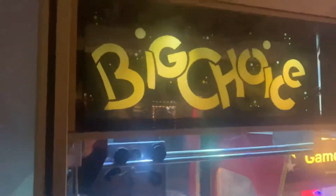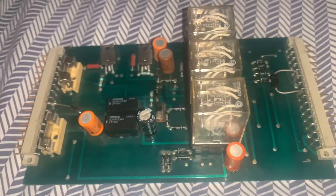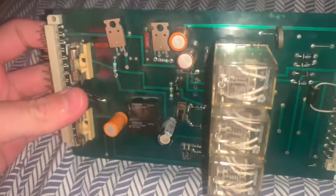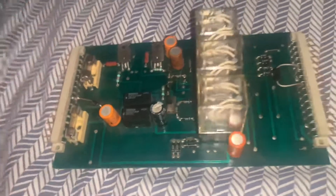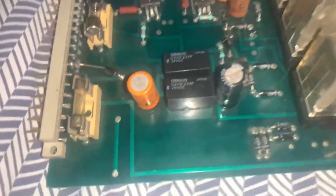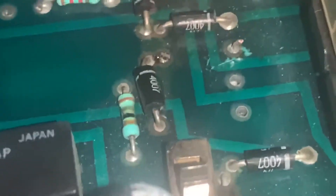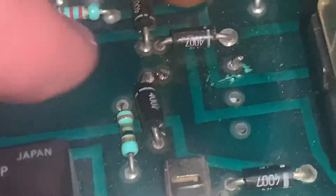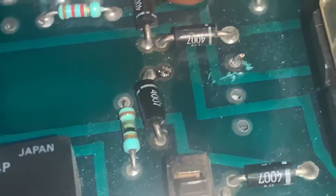Unfortunately the big claw machine is still broken, and I'm going to show you what I figured out is wrong with it. Here's the main controller board of the Betson claw machine — you'll notice it's actually very basic, very small compared to a lot of modern controllers. You'll notice that there is a broken diode; I've already removed it, but this is supposed to be connected with the diode and it's not there.